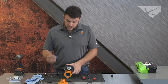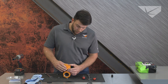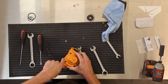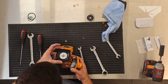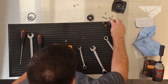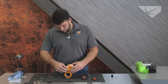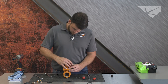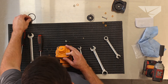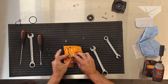From there, we're going to take our spring, put it back, and take the top plate. This will bolt on either way and it will work either way, but there is a right and wrong way. You'll see the flat edge on the top and the curved edge on the side. Both holes do line up the same way with the gasket — you just want to make sure it's all aligned. Then we will bolt the top back on. You will notice we do have some gaskets left over: the smaller one goes underneath this cap, and the tiny one goes in the center puck. You definitely want to make sure you start all the nuts by hand.